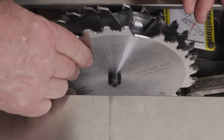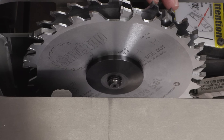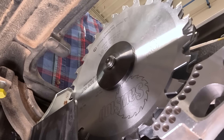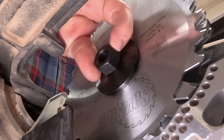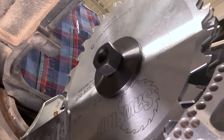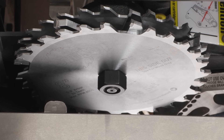If you've tried to put a full three-quarter inch dado stack on your SawStop table saw, you know the problem. There's simply not enough shaft to install both the arbor washer and the arbor nut. The arbor washer is there to distribute the clamping force of the arbor nut evenly across the blade. That even pressure is still important when using a dado stack — maybe even more important. So do you really want to just leave it off and put that skinny little nut against the blade? We don't.